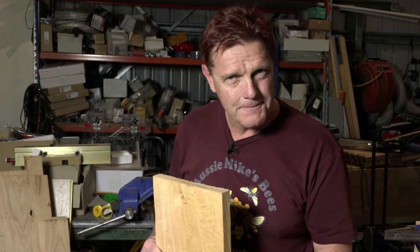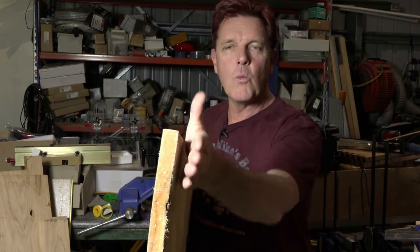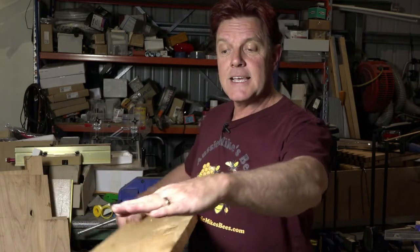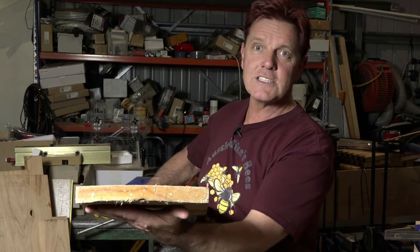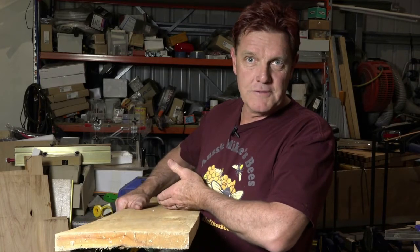The process that we go through is first to go through a planer, which is a machine where you run the wood over a flat wide spinning blade, from end to end enough times to take all of that cupping out, and you've got one side of the wood perfectly flat. Then the next stage is to put it into a thicknesser. It takes the top level down until you've reached a particular thickness, but in the process of doing that, it's pushing the flat side onto the cast iron base and trimming out all of the deformities in the top surface.